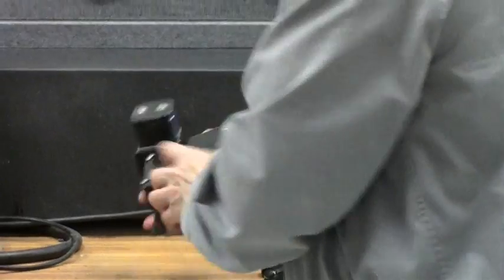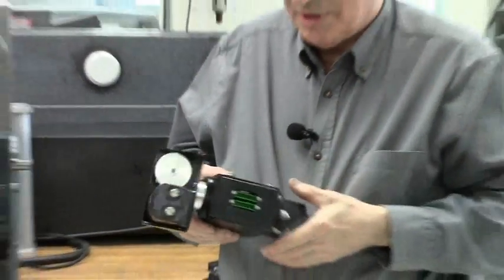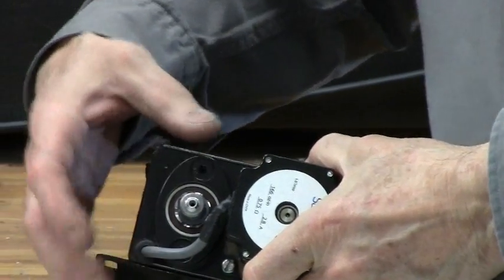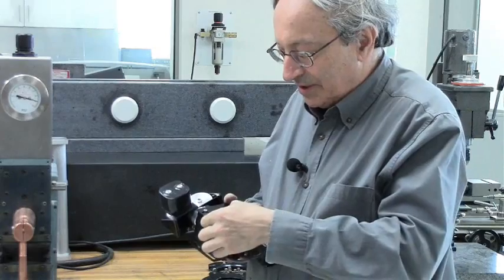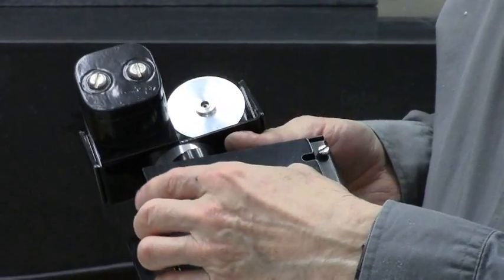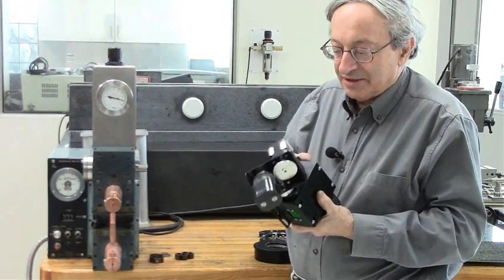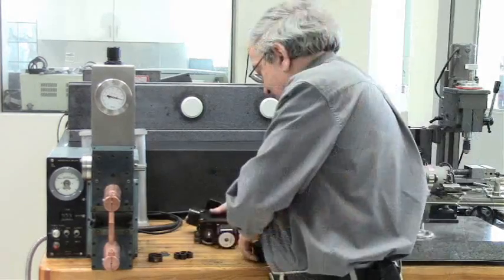Some stuff looks complicated but is actually a combination of very simple structures. This is a gearbox which rotates in two directions on two axes, but it's made just like simple enclosures — the bearing mounts are little inserts permanently attached with screws to the housing just to give more support to the bearings. The gearing is done with timing belts inside; there are also some slip rings. Note that everything is done with captive hardware and key holes so you don't have to remove any screws to open it. Even complex parts can be broken down into a few simple assemblies of spot-welded bent metal, adding thicker sections where needed and machining after the whole thing is finished.